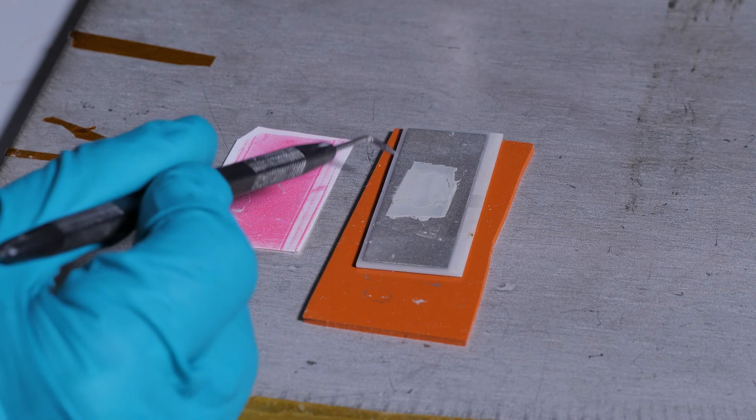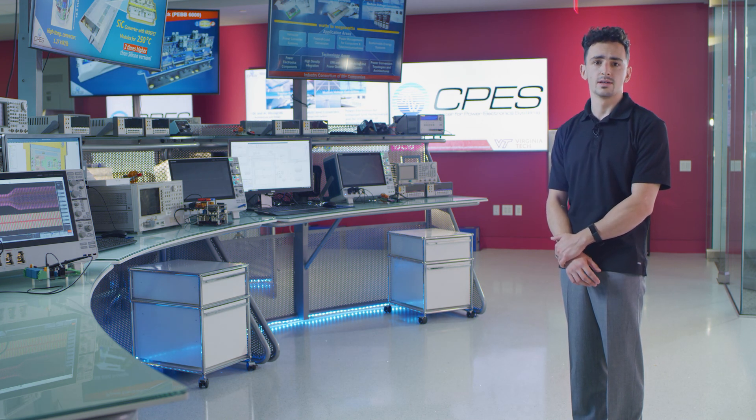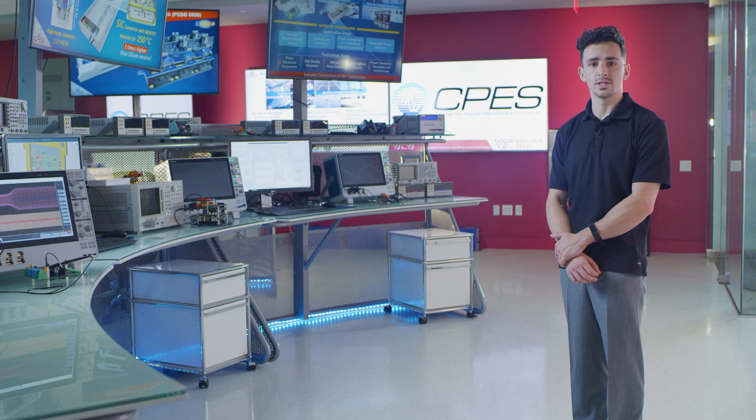I have deliberately left some of the metal area on the DBA exposed so you can see the contrast between the transferred silver preform and the DBA metal. We look forward to the completion of thermal cycling later this year when we can analyze the reliability of the sintered silver bonded DBA substrate stacks that we have fabricated. With that data, the 10 kV silicon carbide module design can continue to improve with increased reliability. This work is supported by Power America and the U.S. Department of Energy's WBGen Fellowship for wide bandgap semiconductor research. Please reach out to me with any questions or comments. Thank you for your attention and enjoy the rest of the conference.